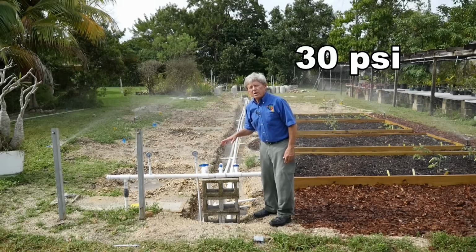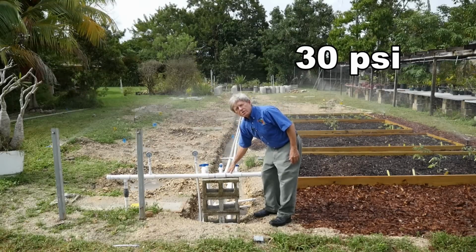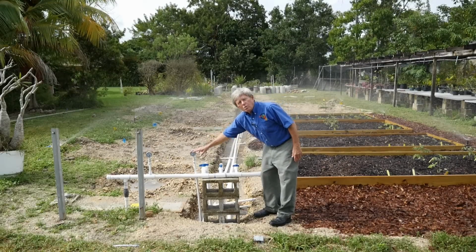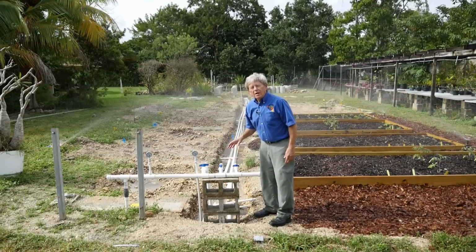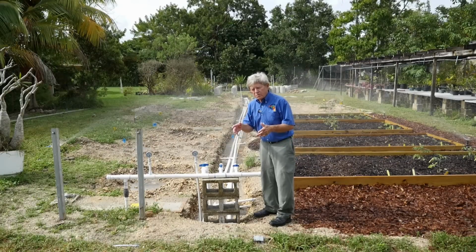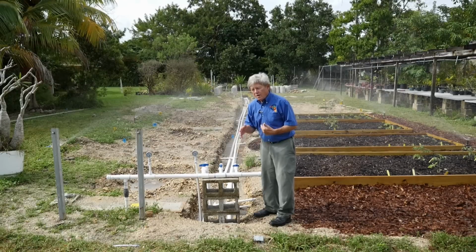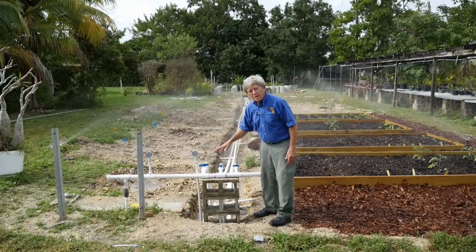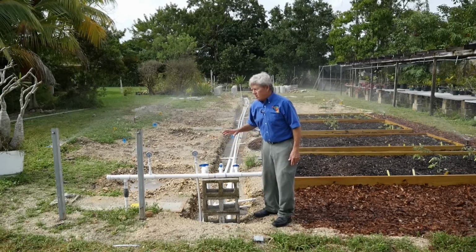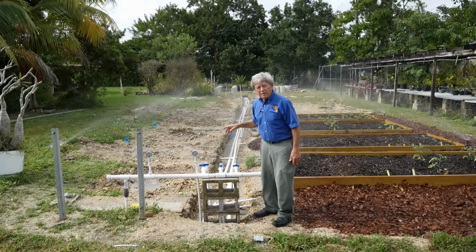When you design and construct an irrigation system, you can't put in 3 different supply lines and then try it out and see which one provides the right pressure. Instead, you use the friction loss table, which is a table that shows the loss of pressure at different diameter pipes with different flow rates. And you need to pick the pipe that's right for the flow rate and other conditions, such as the pressure required at the sprinkler heads.